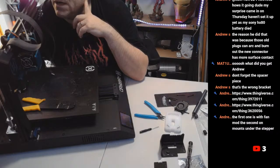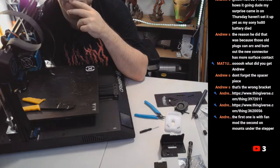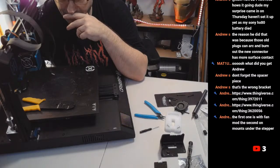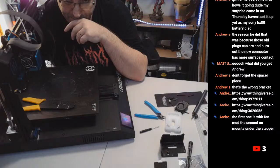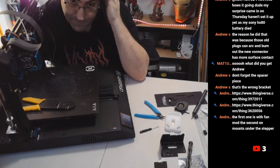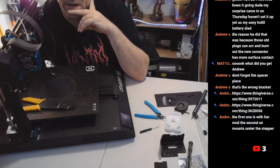Okay, I've got it here, so let me load up Simplify3D and I'll get that printed out. Remove that one, pop this on here, pop that down as the bed, place surface on bed. Center it, and the best thing about it is it doesn't look like it needs any support, which is fantastic. So let's turn off any support that might be needed. Let's OK that. 25 minutes. So that's good. Right, okay, so that's done.